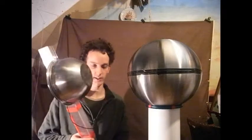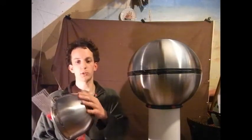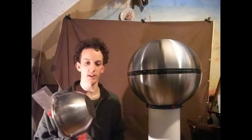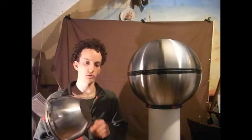Here's what I used to collect sparks without getting zapped myself — it's just another serving bowl, not quite as fancy as the IKEA ones. You should also keep this one clean and avoid any sharp bits sticking out, because they'll facilitate a gradual transfer of charge, which you don't want. And even in the room around, you want to watch out for sharp metal points, which will act to discharge the voltage from your dome.